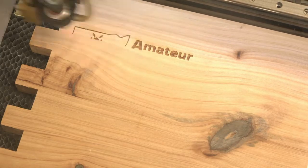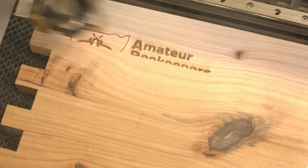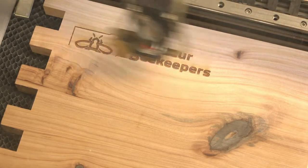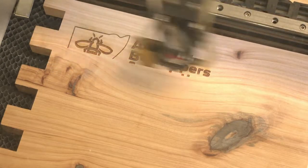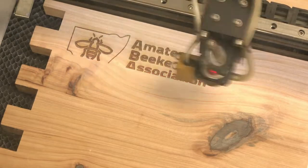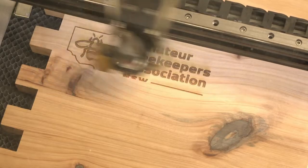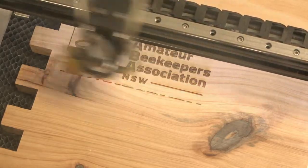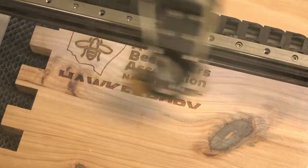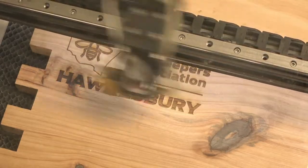I can actually burn really deep. I could go 10 millimeters deep if I wanted to. It would take longer and more power and slower and so on. This scan is going at about 1/2 mil deep, and that colour is the wood charred. It's kind of like watching grass grow, so this is 10 times normal speed. For tech nerds like me, I love watching this thing, but for normal people, I think you'd be pretty bored. It takes quite a while.